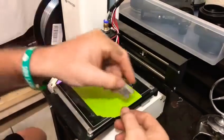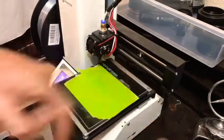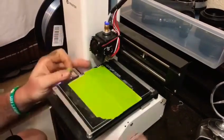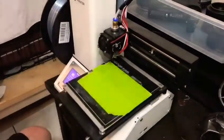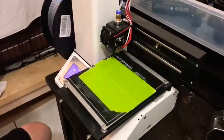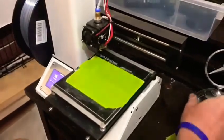The main issue when you do a 3D print is the adhesion of the part to the bed at the start. Just stay around the printer for a couple of minutes until it starts printing, because sometimes you can correct a little flaw with your hands — remove a little bit of filament going to the wrong place — and that's going to avoid a catastrophe on your print.